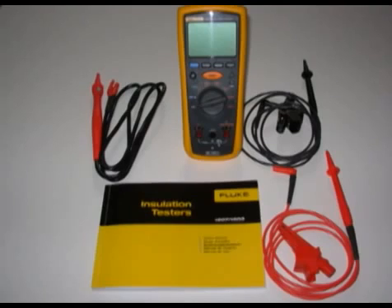After you make the connections, you apply the test for one minute, and after one minute you should read and record the resistance value. Here is what you get with the tester. The positive and negative leads are extremely stout and sharp to make good contact with a case or a coil. There are also alligator clips for the extended 10-minute polarization index test, or PI test.